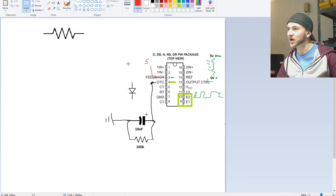Okay, so here we go. Let's connect that up to our 5 volts line from pin 3, so that it can charge the capacitor through the diode. And then when this goes to 0 volts, the capacitor will drain through this resistor only, and it won't try to drain back through other parts of the circuit and cause the amplifier not to turn on, because of this diode blocking the way.